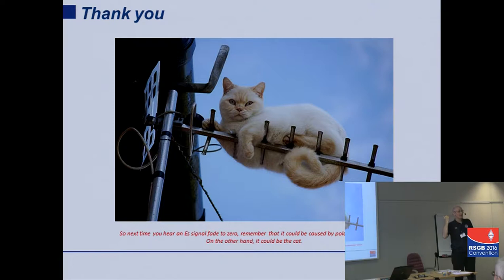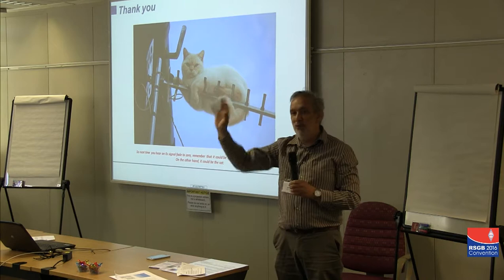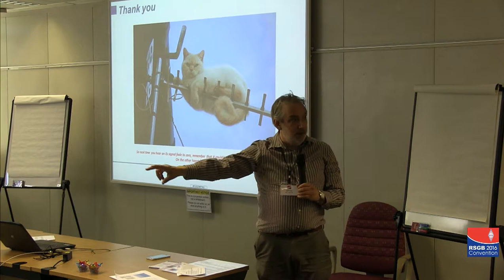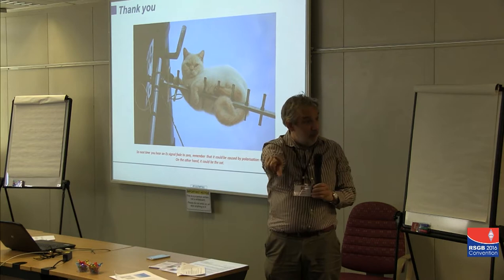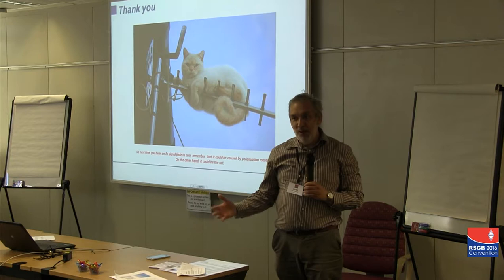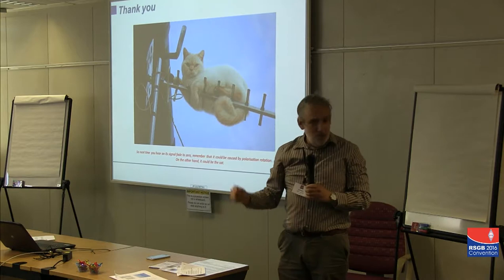Can I make two comments first? And I don't want to usurp your lecture. My forte is 2 meter moon bounce, and what I showed in my last talk was that I have full polarization diversity on 144 now, two channels coming through. I use Linrad, and Linrad gives me the polarization out of the dual channel SDR, so I actually have the phase information. I did this for EME, but I ran it in the Perseids meteor shower, and it is absolutely stunning because you see the ellipsoids changing like that during a meteor burst, which is very similar for ionospheric propagation.